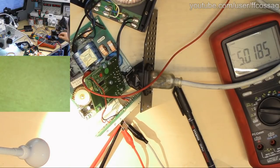So that's the load hooked up. And again, as I start the load, we should see a small drop there, but not a huge one. So, 100 milliamps. And it actually goes up because it's compensating. It's got a pretty tight feedback loop, I do think. So 100 milliamps was fine. Let's just jump straight to 300 milliamps. Now that's fine. 500 milliamps. That's fine. This can probably do an amp. So we are going to try drawing 1 amp.